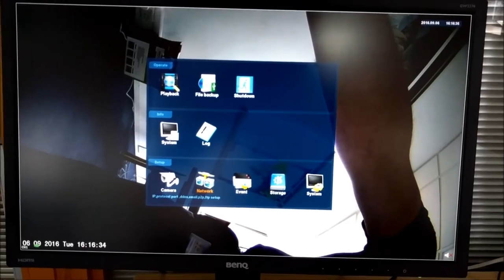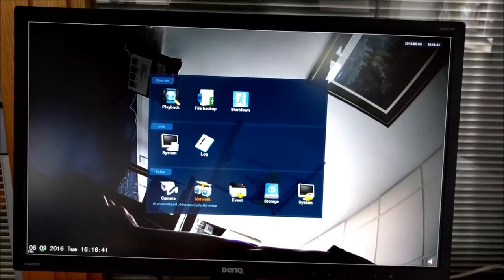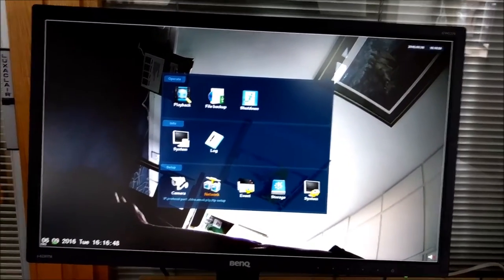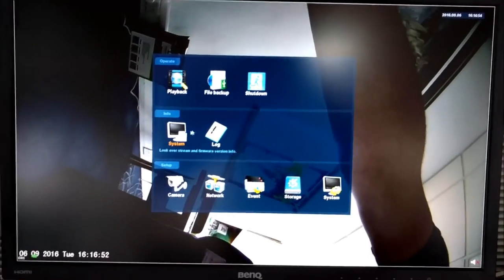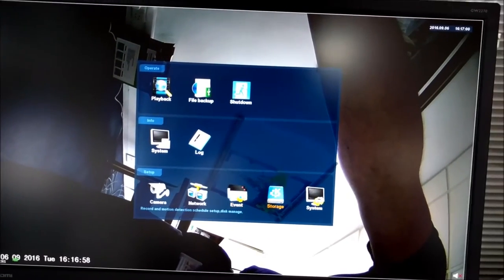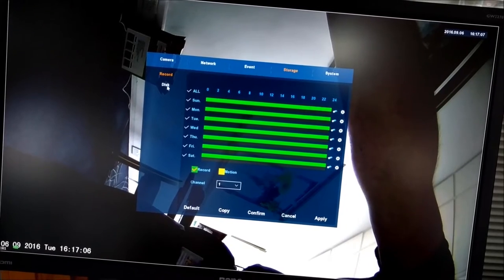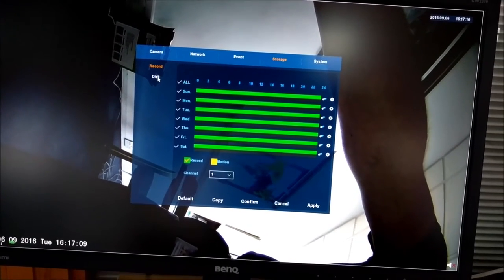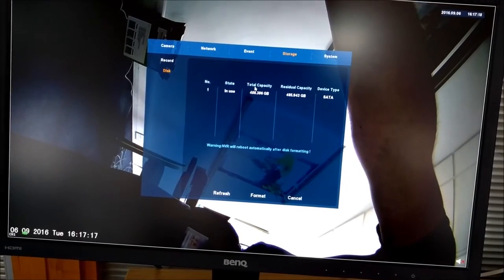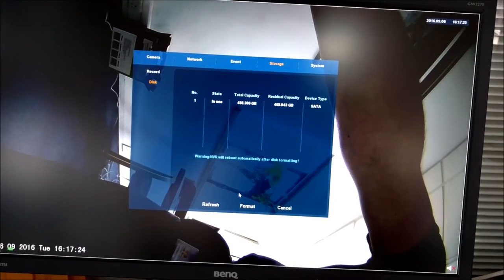The Network section is where you set IP addresses, or if like 99% of setups you've got a DHCP server — whether built into your standard broadband router from Sky, Virgin, BT, or something more complex — it will automatically give your recorder an IP address. Setup Events is for configuring motion detection, video loss, and what to do in those events. Storage Setup is where you manage your hard drive; this particular unit has a 500GB hard drive, but the main kit usually comes with 1 terabyte, giving you double the disk space. You can highlight and format the disk from there.